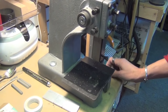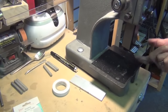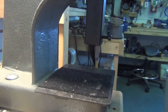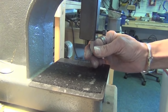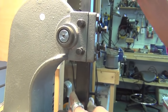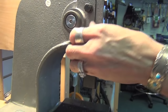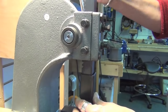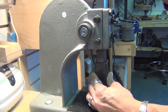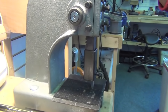It's really just a matter of inserting your letters into the slot and using the set screw — just finger-tighten it enough so it doesn't wobble. Now if you're getting wobble in the ram, you need to tighten up one or both of the screws here so you do not get any wobble. A wobble is again going to take the direct force from downward to either side-to-side or front-to-back, and you're not going to get a firm enough impression.